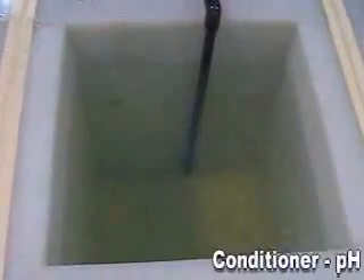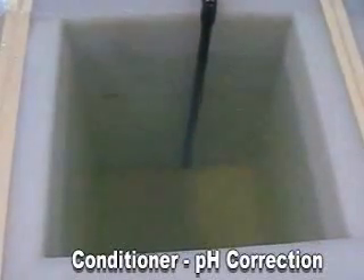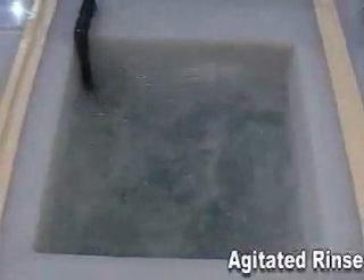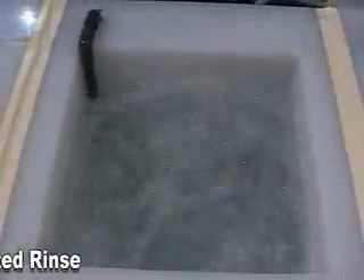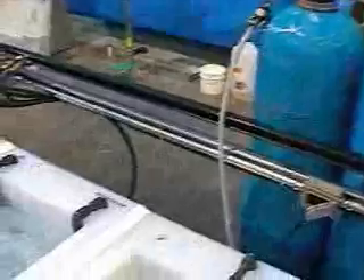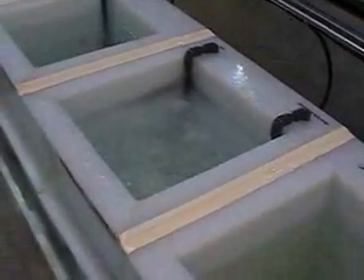The Blackfast rinse waters could be directed to the sanitary sewer without any environmental concern. After rinsing, the component is pH corrected in a slightly acidic conditioner for 15 seconds. After pH correction, the component is further rinsed and neutralized before actual blacking. This rinse water is recycled through charcoal to remove soaps and surfactants, and then is returned to the previous alkaline rinse tank.